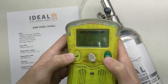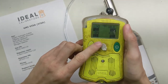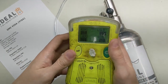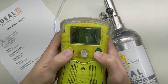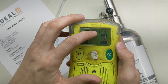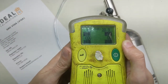To get into normal reading mode now, press and hold Enter to done. Now it's back in reading mode. We're going to turn the gas off and unhook it. I should have popped this off first and then turned the gas off — that way you don't have that happen to your pump. Now this is going to clear out the gas that's in there and clear the alarms. The button you press to stop it from alarming is press and hold the right button. We'll wait and let this go back up to all zeros and 20.9 — and there it goes. Everything zeros again and here we have 20.9 on the oxygen sensor.